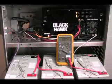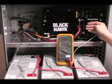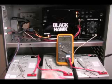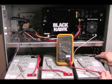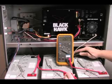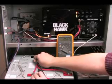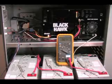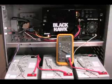To test the battery string, take your probe and press the test button. The test LED will come on. After 10 seconds, the inverter will start. When the inverter is running, the fan will turn on and the amber line LED is on, indicating it is running online. Now you can check individual batteries by connecting your probes to the positive and negative terminals. The first reading is 12.6 volts, battery two is 12.6 volts, and battery three is 12.5 volts. To terminate the test, it will stop on its own or you can use the probe to press the test button. It will automatically reacquire the line and the test is done.